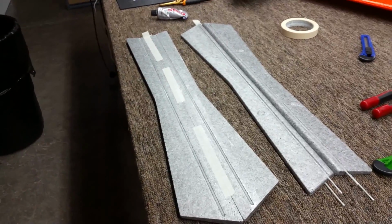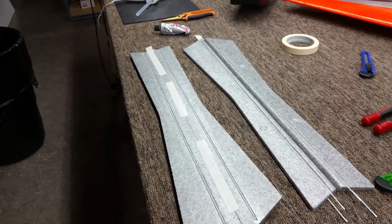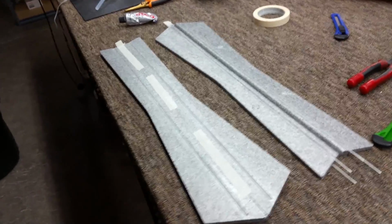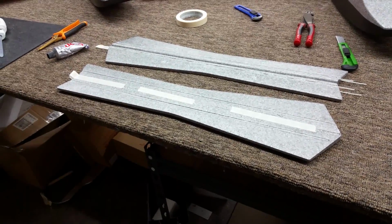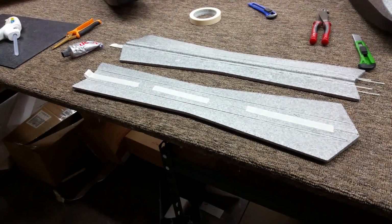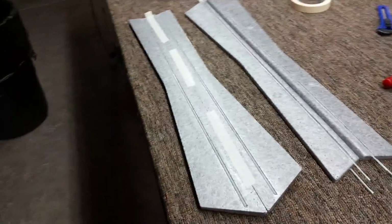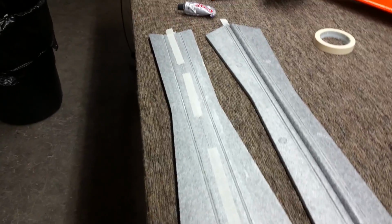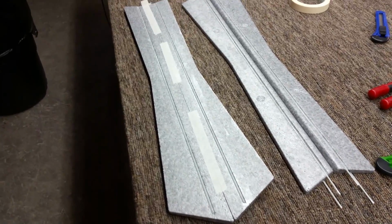The drawback is the balsa Elevons, you know, are going to be a little bit easier to produce. They are going to be fairly true and straight and stiff, but with the slightest bump, you could actually damage them in the field. So the deal with these is if you take the time to make the Elevon straight out of the EPP and you do it with this process, they end up being very, very, very rugged. So in this process, you're going to need a hot glue gun.